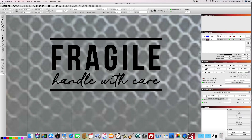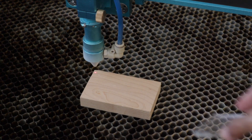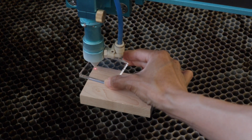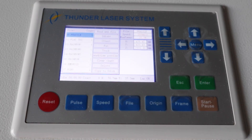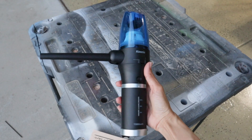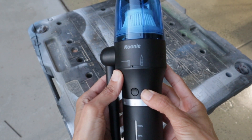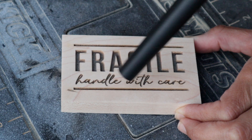I'm using my camera, so I just updated the overlay and set the laser to user origin. Place your block of wood onto the laser bed and move the bed up or down to focus — I'm typically at six millimeters for just about everything. Drag your file over to the block wherever you need it to start the engrave. Then on the laser, bring up the file, frame it to make sure you are lined up and straight, then hit start. For these first few stamps, I used 400 grit sandpaper to sand away all the debris and char. Sandpaper is another must-have tool for any type of woodworking or laser work — I use it on every single engrave I do.